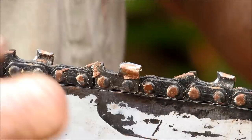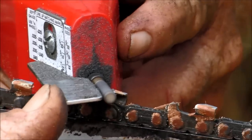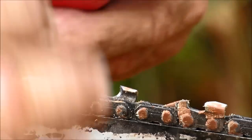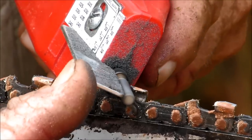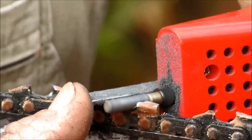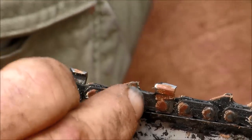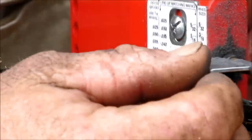No vices, no locking up, no strain, no pain, and no yelling and screaming. Line it up, square it off — 1, 2, 3. That's made the top plate square and sharp, so now I put the bevel on it. To put the bevel on, I simply roll my left hand slowly forward whilst extending my sharpener left and right across the bar. Put as much effort into the side as you have into the top, because you don't want to put what's called a back slope into the tooth.